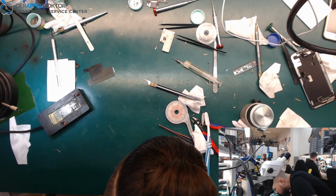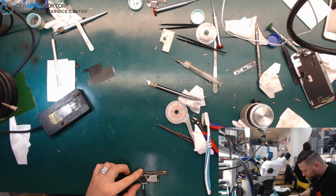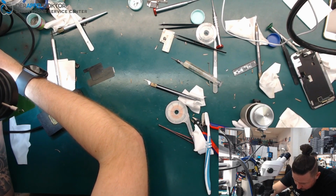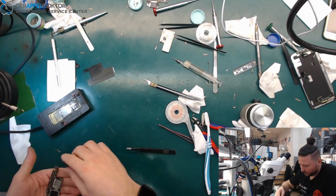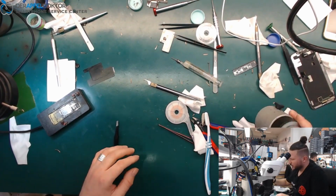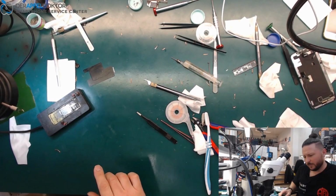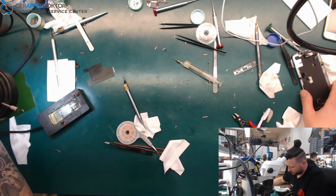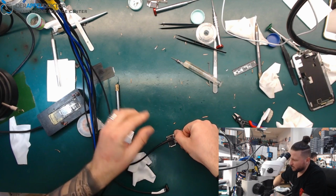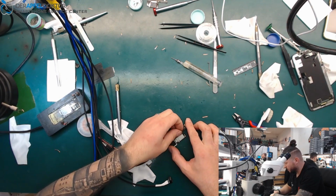Okay. I hold it into the dust absorber just to cool it down. And now we just wait a short time for cooling down. Before I just wanted to speed up and I don't want to risk anything now. So first I have a look if we have no short. We have a short on VCC. Right, if we assemble the board halves back together we get a short on VCC.